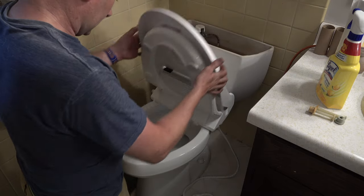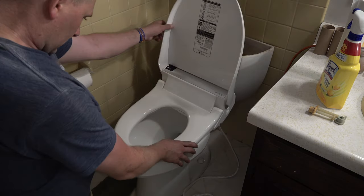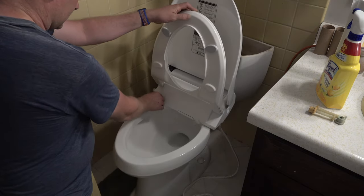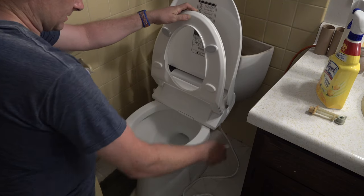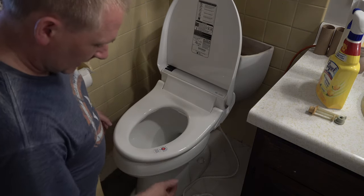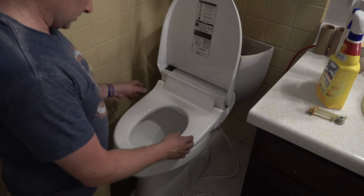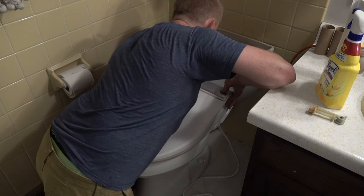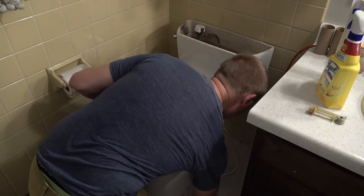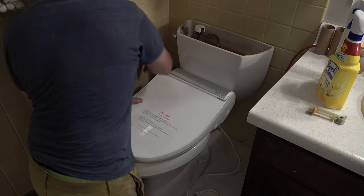Essentially what you're doing now is aligning the bidet with your toilet — I'm going to move it back a bit. I want as much surface area coverage over the bowl as possible. Taking the excess tape off now. Now we have it lined up, and you can play with this later if you need to adjust it. I'm fairly confident and happy with that positioning — I still have space behind and the lid stays up. Going to go ahead and tighten these nuts down — not crazy tight, just nice and snug.